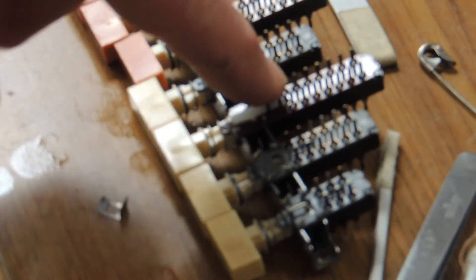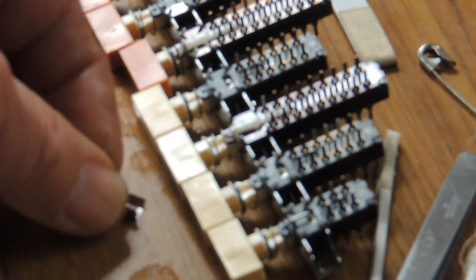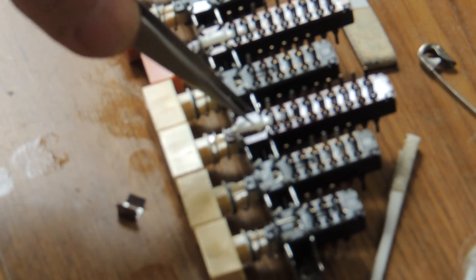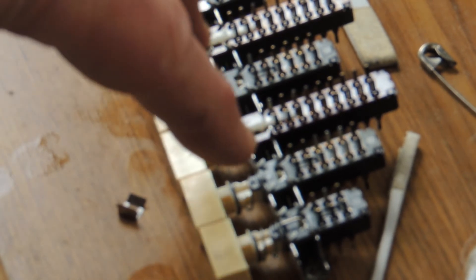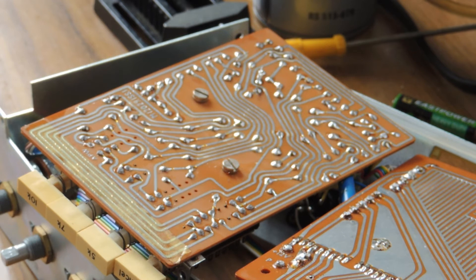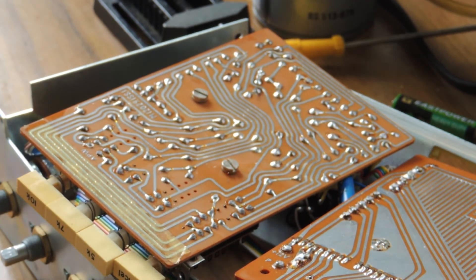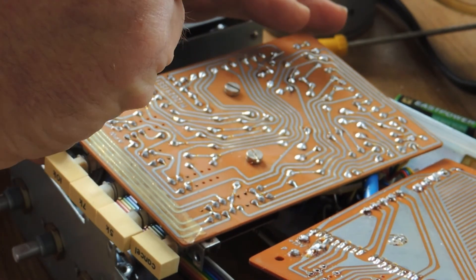That one I've just done — and there's this little spring clip to put back in just on the right-hand edge. That is held in place by the two little tabs, so take care when removing and re-bending the tabs, because that is what springs the latch. These four switches interlock — there's a sliding latch bar inside and that spring pushes it to the left. After the success of the source selector, I'm going to do the EQ switches as well.